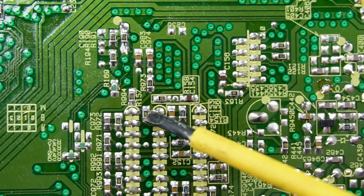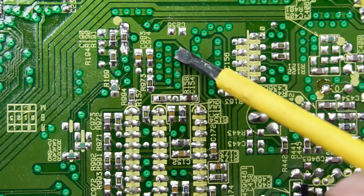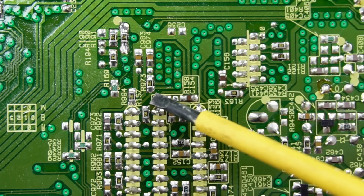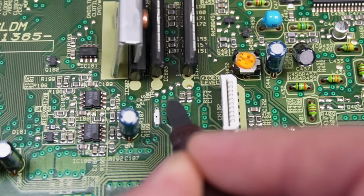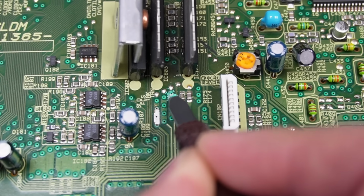However, looking from underneath we can see pin 1 of the tracking focus goes up through here onto this string of wires there. That's handy. Similarly, pin 1 of this chip for the sled drive snakes around here. And on this row, those look like good places to stick a test point. I just want to scrape the solder mask off the top of this, so I can solder a test hook on.